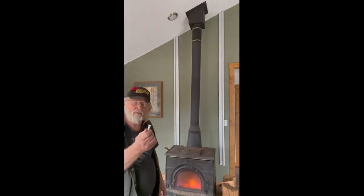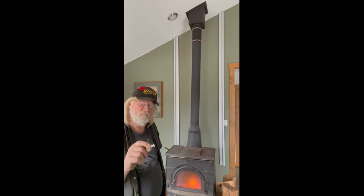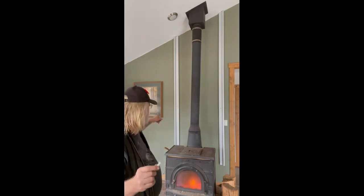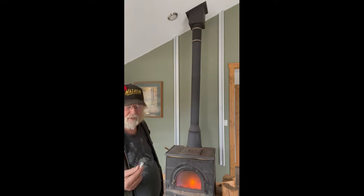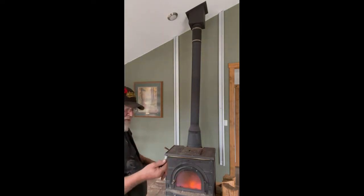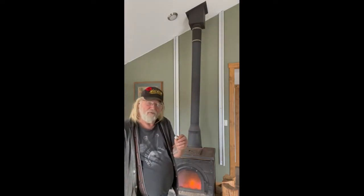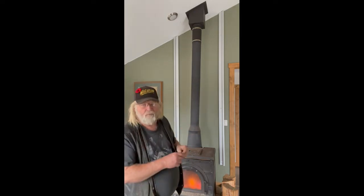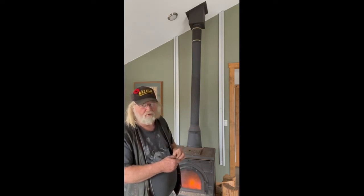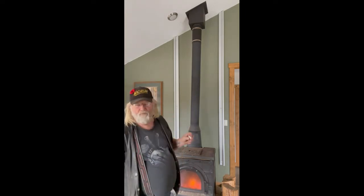But I got these little plastic anchor mounting things to put into your drywall, because there's no studs where the screw had to go. Not like the old paneling, I screwed that directly into the studding, but here it's out of width, so it's in between the studs. And this is a once over deal, which I found out. You can use the plastic insert several times, but you can only put it in the hole once, because it screws in and it really mangles that drywall. It'll hold really good the first time in, but you can't put it in the same hole twice. So I had a little bit of a problem on the very first one I put in, of course.